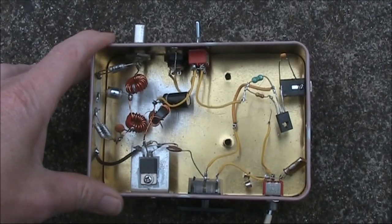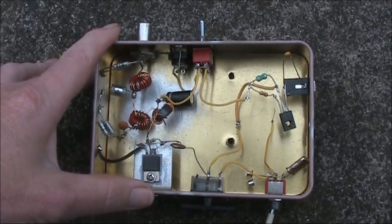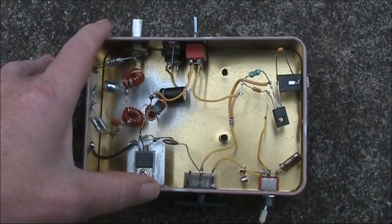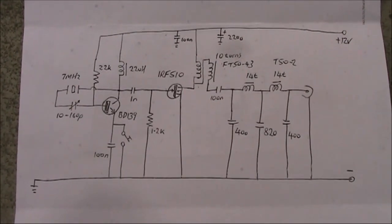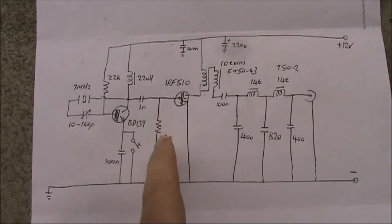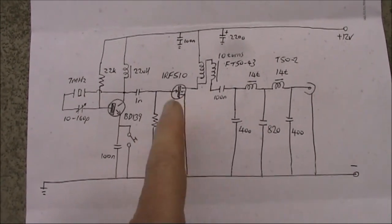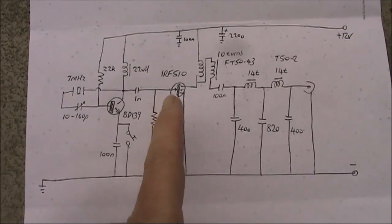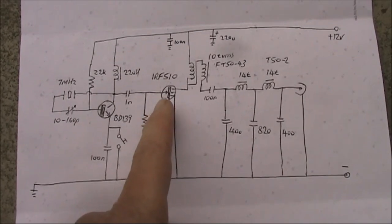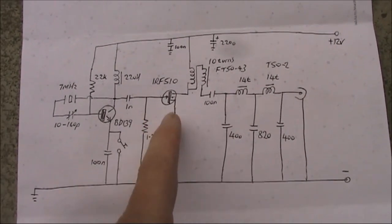I've now added an IRF510 RF power amplifier. That will provide significantly more output, and there will be some extra isolation between the oscillator and the antenna, so there may be a better quality note. This is the circuit. It's a very simple IRF510 circuit, and you'll notice that unlike voice transmitters, there's no DC bias, no voltage regulator diode, potentiometer, or whatever. That can be a problem, because when you apply too much voltage on the IRF510, you can easily blow it up. There's no need for that circuit here, so I've left it out.